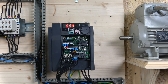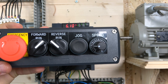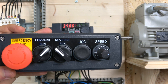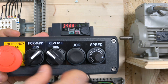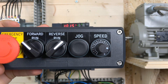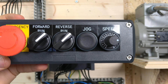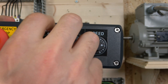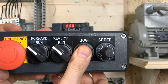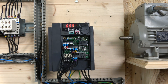Cover is on — let's see how it works. Here's our station: run forwards — fully operational. Acceleration is set to 5 seconds, which you can change. This drive requests you turn it off before spinning the other way rather than overriding — if you close both signals it will just stop. That's how run forward and run reverse work. The jog speed can be adjusted in parameter 15, and the jog acceleration in parameter 16. That's the 2-wire control — let's jump to 3-wire.